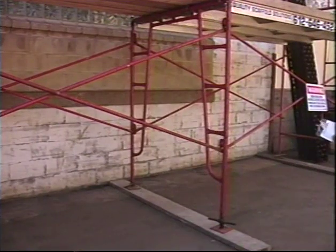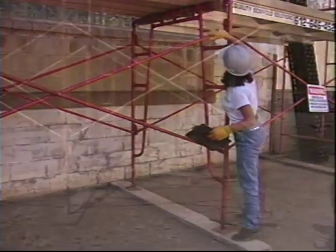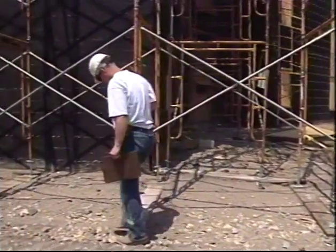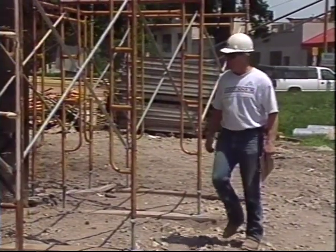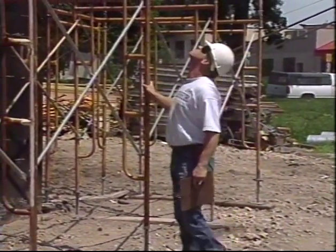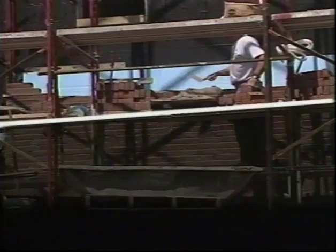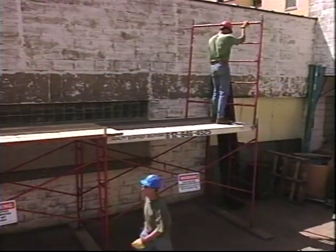Once a scaffold has been erected, it should be inspected frequently to make sure that the system is intact, particularly that there isn't any settling at the foundation that's pulling the scaffold out of plumb or putting extra strain on the ties, that the ties to the building are intact and have the proper tension, ladders, planking, and platforms are secured, there are no loads that are causing the planks to deflect 1.5 inches or more in a 7-foot span or 2 inches in a 10-foot span, and the work areas are free from obstructions or debris.